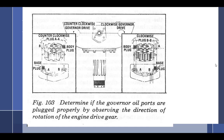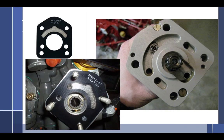You guys seem to have this pretty well, but we're talking about governors. The direction of rotation was based upon where these plugs go. One of the things I find confusing about the book is it lists counterclockwise before clockwise. I associate clockwise with A and counterclockwise with B, but the book says if the plug goes in B, it is clockwise. So: the A hole is open, that's clockwise; if the B hole is open, that's counterclockwise. There's also a special gasket between the engine and the governor with a raised screen — you don't push it toward the engine, but there is a cutout on the prop governor side.